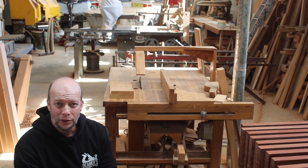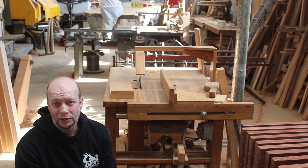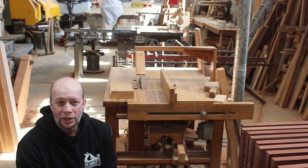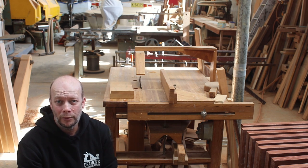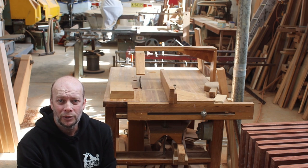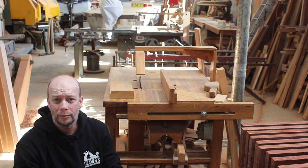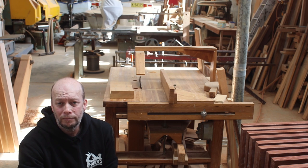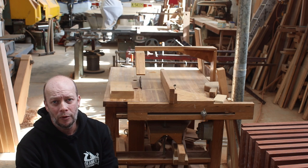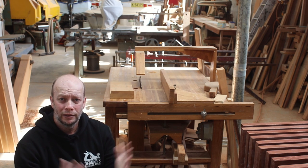When it comes to jigs for table saws, have a really good think about what you're doing. At the end of the day, a saw is meant to cut straight — that's it. There's no flex in the blade, so all it wants to be doing is cutting straight. I know jigs can be very handy, especially for people that don't have a lot of equipment. There were times years ago when we didn't have all of that machinery and we had to think of other ways to do things. We've cut raised panels for doors on here — still cutting straight — but we made a bevelled fence to go on there. Just bear in mind what you're doing and whether it's safe practice, because it takes literally a split second to have a serious accident.